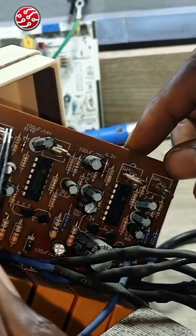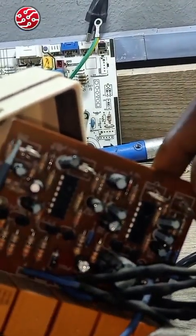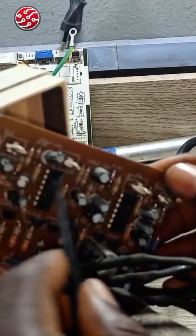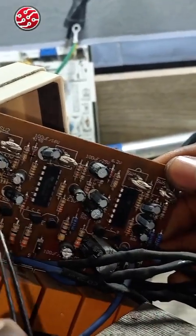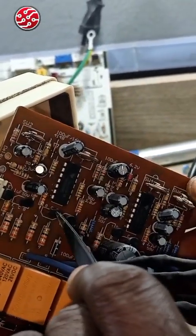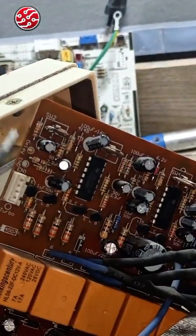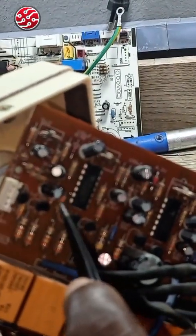If you vary the variable resistor, the voltage difference across it changes. The voltage comes in and the legs are at different potentials — this leg might be zero volts, this leg might be five volts, as you are varying the pot. It is sending a voltage to the LM324, which is a comparator. It compares the voltage you are bringing in with the voltage at the other input before giving an output. The output of this IC is connected through a 2.2k resistor to a transistor, then through a 33 ohm resistor to the relay.